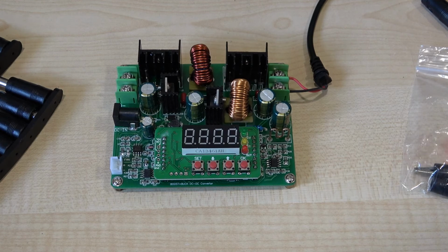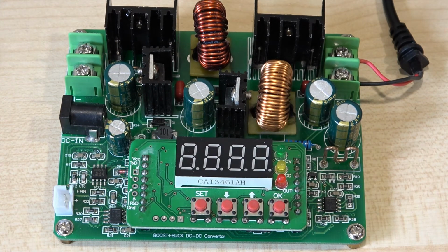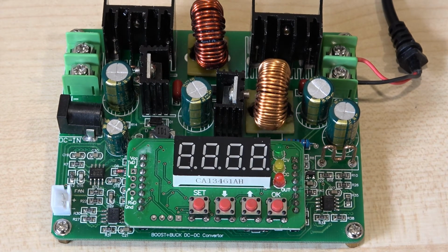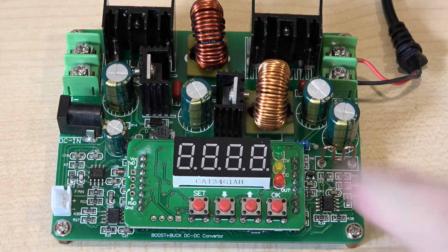And I'm amazed to report it works rather well. I've had this actually some time, probably about 5 years now, and I've used it for all sorts of things, and I must say it's been pretty good. I know you don't hear that from me often. I wanted to draw 2.3 amps at 19 volts, which according to my mathematics in my head, which could be questionable, is about 43, 44 watts.